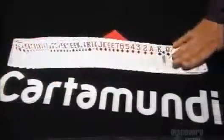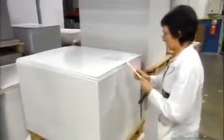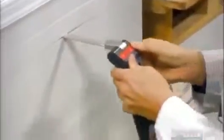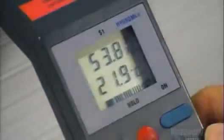Whatever the hand, a winning combination of technical features makes these playing cards durable and cheater-proof. Industrial humidifiers control the moisture level of the cardstock. This prevents the cardboard from drying out and warping. Technicians regularly monitor the cardboard's temperature and humidity by inserting a flat probe 10 centimeters from the top of the 3,000-sheet stack.